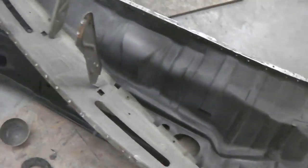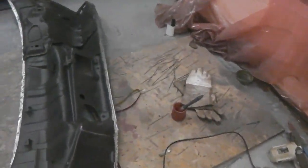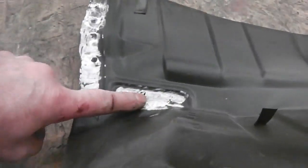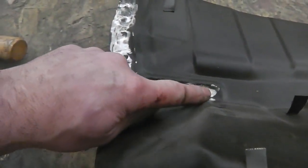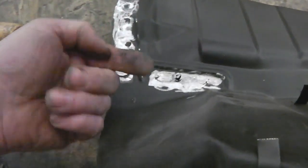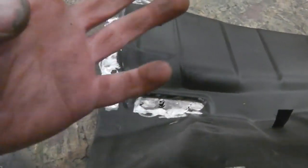Let's get prepping. Dashboard. Okay, I've done the dash edge repairs. New metal gone in to finish that lip off on the dash. Same at the other end, so that dash top's good to go. And now we've mixed our weld through primer, 60-40 mix, in we go, and we've prepped up all our receiving faces, including these landing panel back sides, because that'll burn otherwise. So we take this body primer off, even though we're not welding that side, because it's going to heat up and burn back. This is a welding face for the bulkhead top panel.